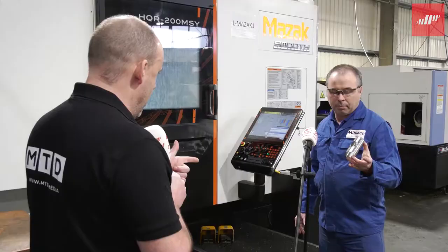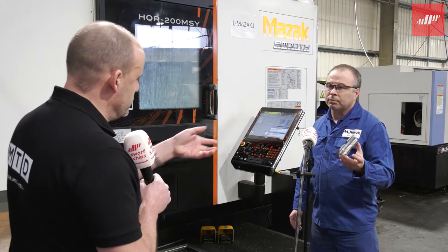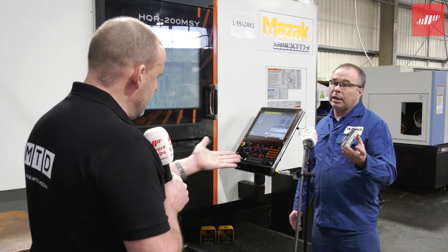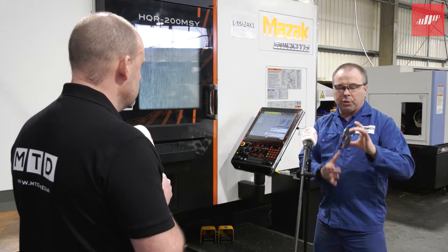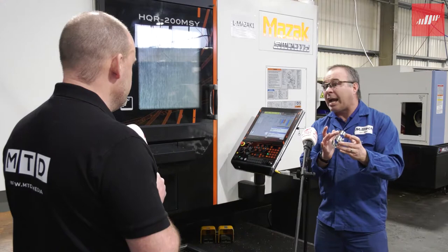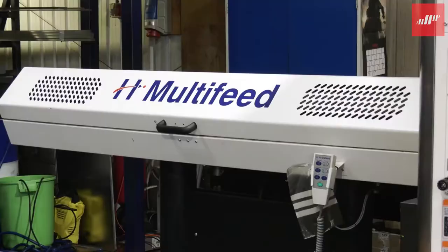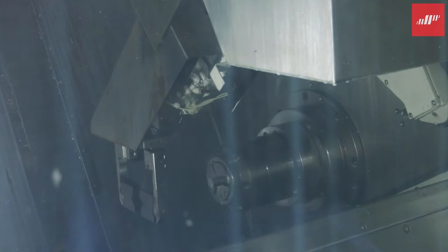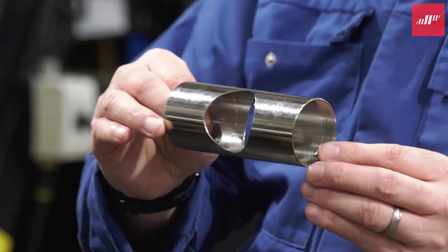I don't want to get away from the fact that we're talking about automation here. This machine enabled you to run these in quantities in an automated fashion. Even with the work holding — how do you grip something like that once you've done the U-drilling operation? With a part like this, it's all to do with aesthetics, all about what the part looks like. To manufacture this and still maintain the surface finish on the outside, we actually got a long series set of jaws to hold internally. We feed the part in on a bar through the bar feeder, machined and drilled the hole in it, machined the ports around the outside, and then fed it through to another set of jaws on the second spindle to hold it internally so we didn't damage any of the outside.